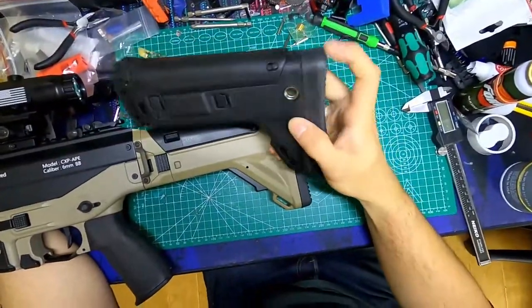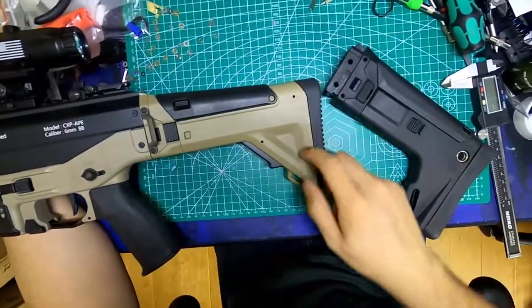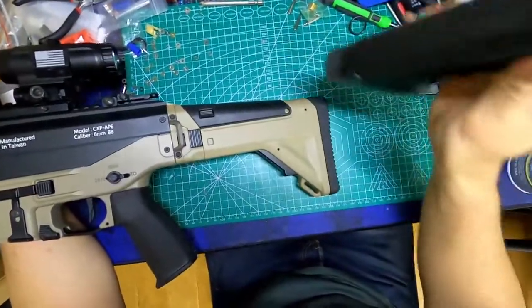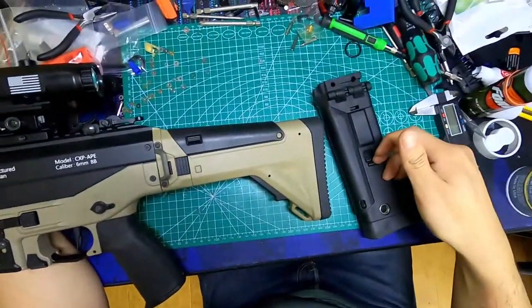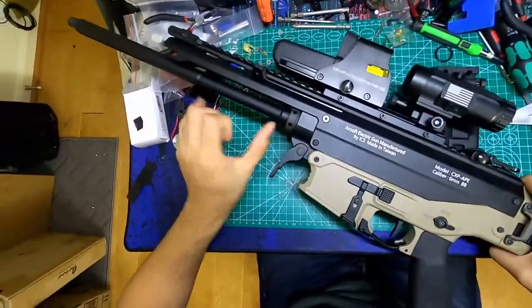It's going to be quite thin. I could mill this out more so I can get a thicker block of metal in there. I can also grind that plastic down and replace it with a metal pin. While I'm at it, I might as well rip this mount hole out of this one and drop it in here. Or maybe take this one — I like this stock, it's very sturdy compared to the other. But I won't be able to put my battery in it, so if I go with that, I'll likely mount the battery up front.